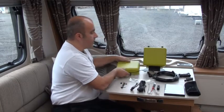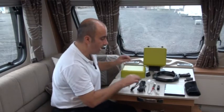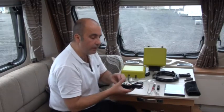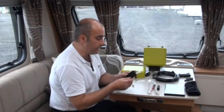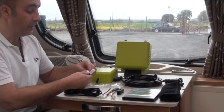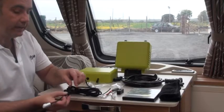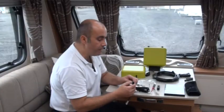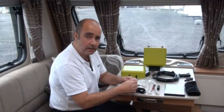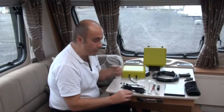Next we need to get power to the box — 12-volt DC. We've given you four metres of DC cable with a male and female end; you simply snap them together and you're good to go. At the end of the cable you'll find a fuse. Your main breaker fuse is probably about 20 amp, and this box uses about 10 and a half amp at start-up, so we've put a 15-amp fuse in line.